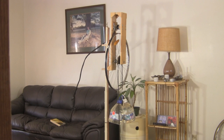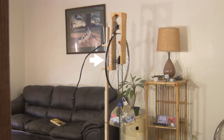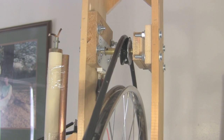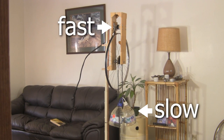The reason for the bicycle wheel is that the slowly falling masses turn these sprockets slowly. But the big outer rim of the wheel is turning faster than the small sprockets. That faster speed is passed onto this small pulley, so that we can get the necessary speed to run the generator. So the slow falling of the masses is converted to faster turning of the generator.